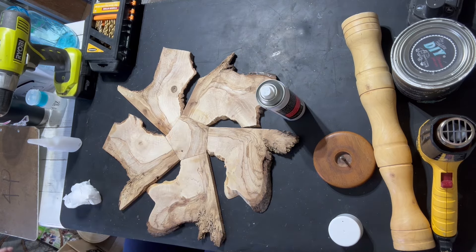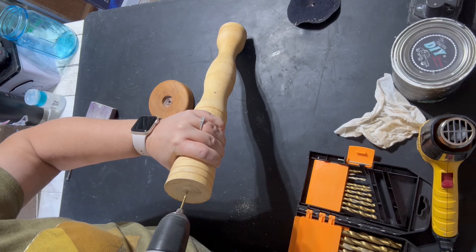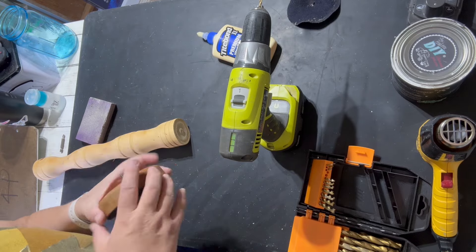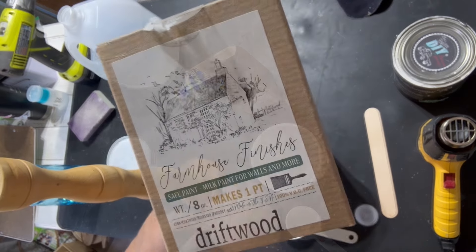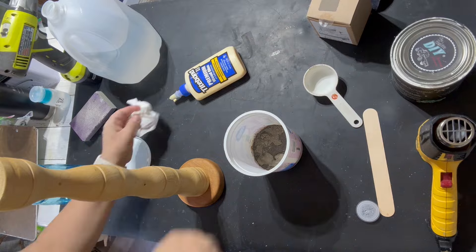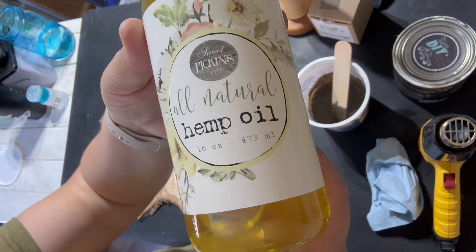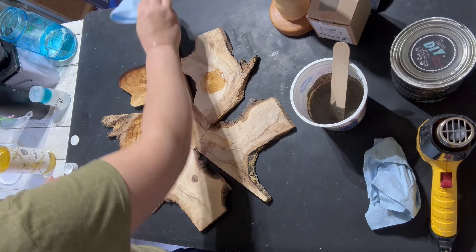This is a super cool piece — he did make it by hand and it's sentimental. He's not able to do any woodworking anymore, but I love having something he's done personally. I drill a hole in the bottom of the long stick and use Titebond wood glue to place it in the bottom. Then I'm using Farmhouse Finishes Milk Paint at a one-to-one ratio — one part powder, one part water — mixed really well. It's a watery finish, but I'm just going to darken up the wood a little bit. Then I'll take some all-natural hemp oil from Sweet Pickens and give the wood a nice drink — it just brings out those gorgeous colors of the natural wood.